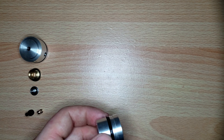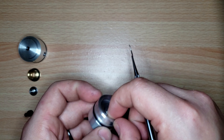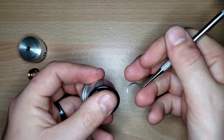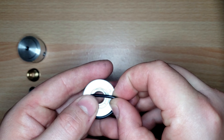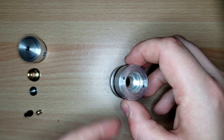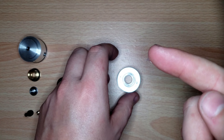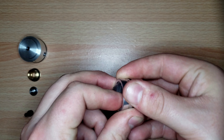To change the external O-ring, take a dental pick. There's a shoulder here with a nice little groove. Slide the dental pick under the O-ring, take it the other direction, grab it, pull it across, and pull it out and over. Take your new pre-lubed O-ring, stretch it over, and push it into place. Then take a little bit of lube and smear it all across.